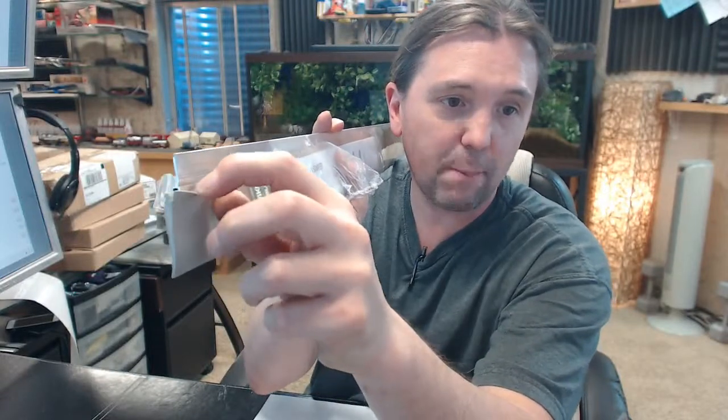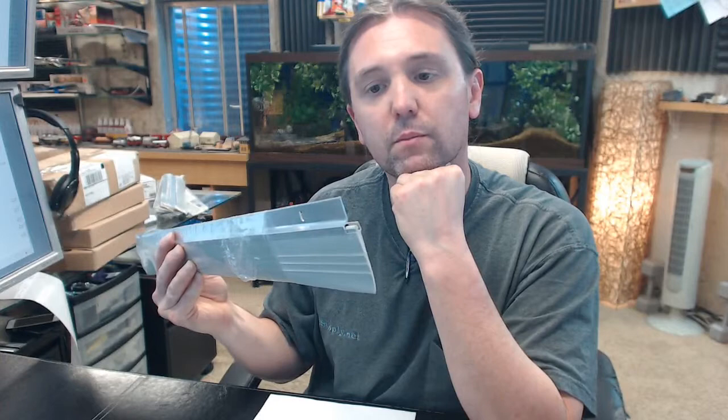This is a nice design because there is a flap on the back side of the vinyl sweep itself, and that will allow you to help trap any water that gets behind the extrusion. This aluminum is relatively thin — it is a builder's quality sort of sweep, so it is not intended to be compliant with any sort of heavy duty application. As you tighten the screws down there could be an imperceptible amount of deflection allowing some water to get in. It's a problem with lower quality, lower cost sweeps, but that flap in the back helps remediate that issue.